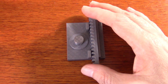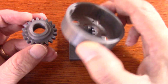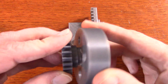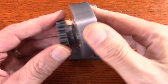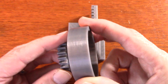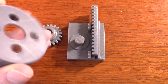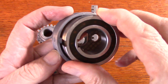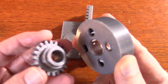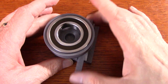It's actually a different rack — this one here. I made some changes to it because I have this cage here that will enclose the sprag clutch, and then this just fits onto the top — if I can get the orientation correct, like so — and now it becomes effectively one piece, but it can come apart fairly easily. This has four holes in the back so that I can push the clutch out, and the clutch itself is keyed, as you can see here. I just put the clutch in like that, and then put this in — it's keyed as well — and then I can put this on here, and you can see that rotates very nicely.